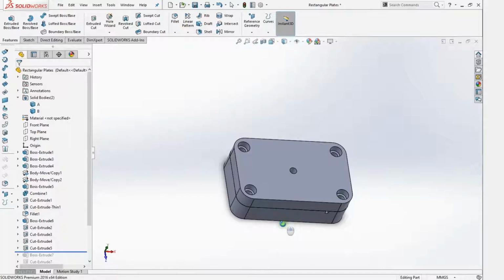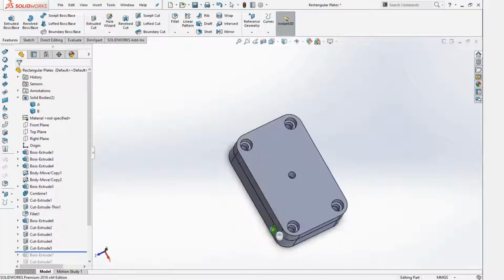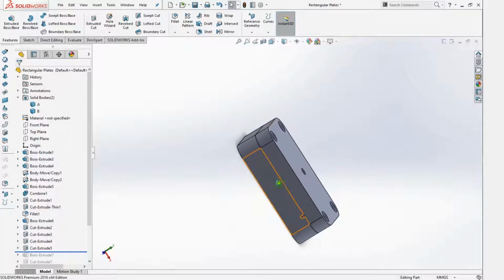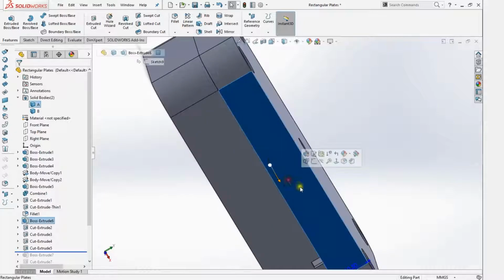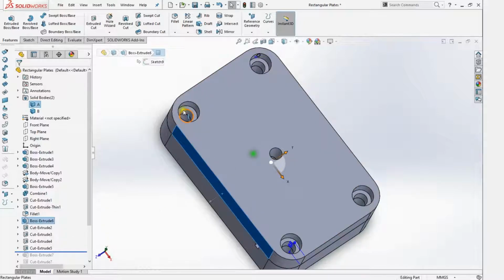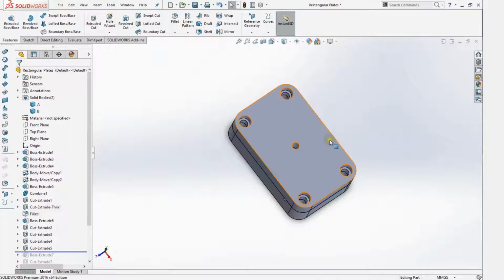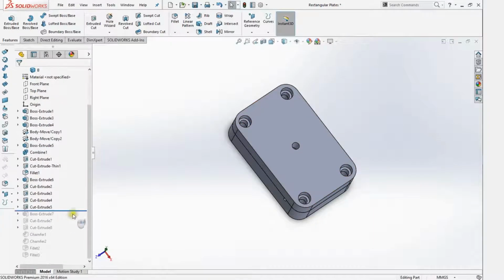This works really well, and you're sure that these parts won't go away from each other, because that's what you would normally see. You inject here, and then perhaps this upper part here will just move away because of the high pressure. So it's a really good idea to use screws and nuts if you have the opportunity to. I know that sometimes there's not room for it in a mold, but yeah, if you can fit it, then do it.